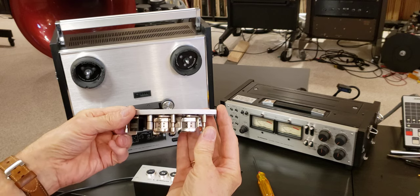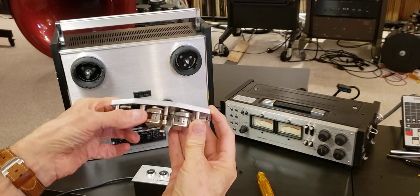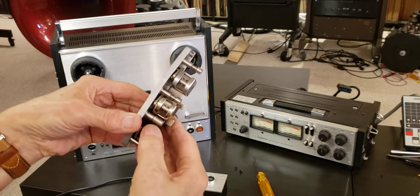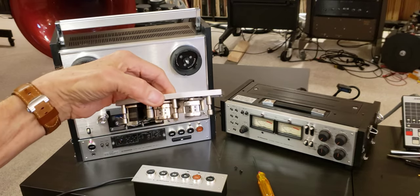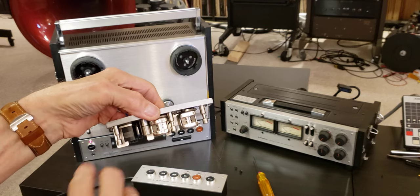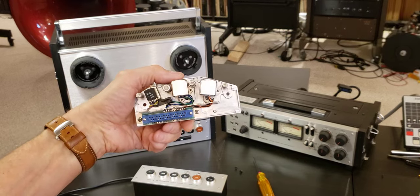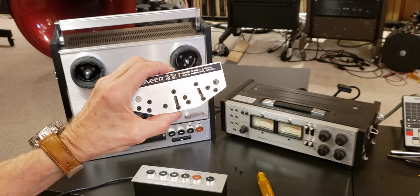Unfortunately, it doesn't rise quite to the condition or expectation of real professional machine, because it has flutter roller here, but you would like to see one before the playback head. Why this particular solution, I don't know. But that's what it is. Otherwise, it's a very well-made professional head block. Very high quality.